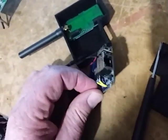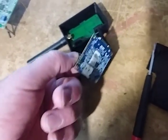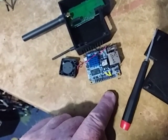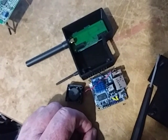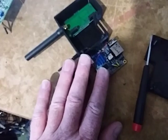That's worked very well — it's kept the boards nice and cool and they've been very reliable. The added benefit of the Orange Pi board is it's got an Ethernet interface, and these boards support Power over Ethernet. There are a couple of links you have to do on the back of the board, and then I can use just a little power injector and house this up in the ceiling if I want more range out of it.